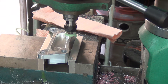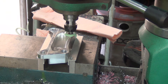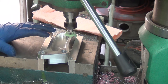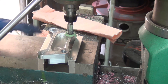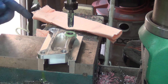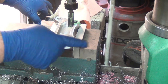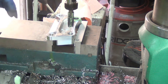I'm not hitting on the bottom — plenty of room — but I need to make sure it's threaded through far enough so the whole thing is threaded evenly and I'm past that taper on the end of the tap. And it is oh so sweet. Stuff like this makes or breaks whether you want to go into production — this works well enough that I could have a dozen, two dozen of these lined up. Otherwise you've got to hand-tap them all. In production I would create soft jaws that would register it, then I could put it in and do every hole, then move it to the other hole and do every hole — or I'd have the DRO set.